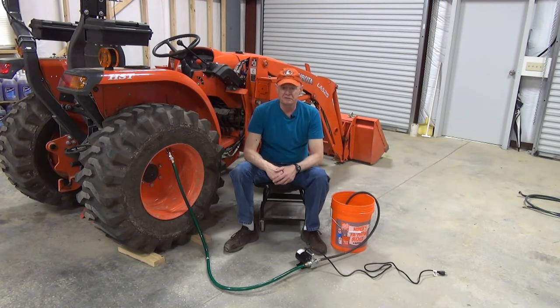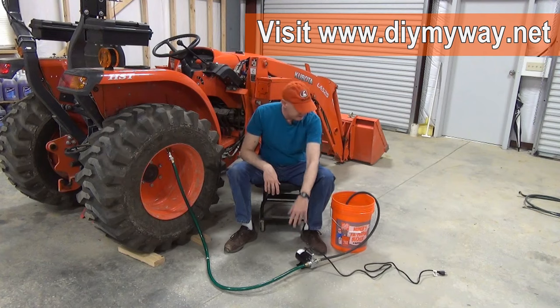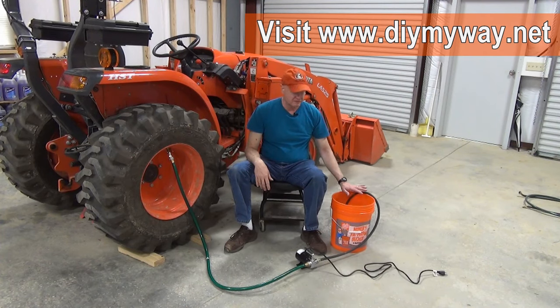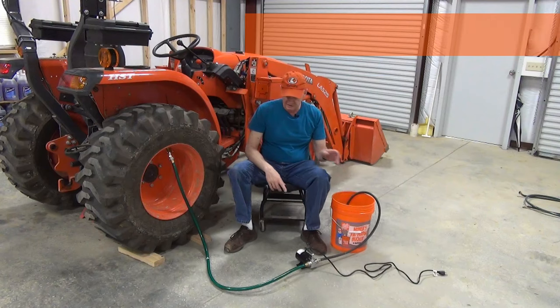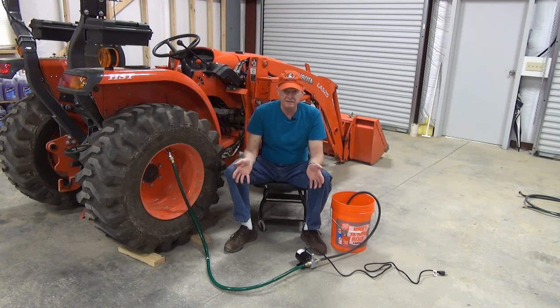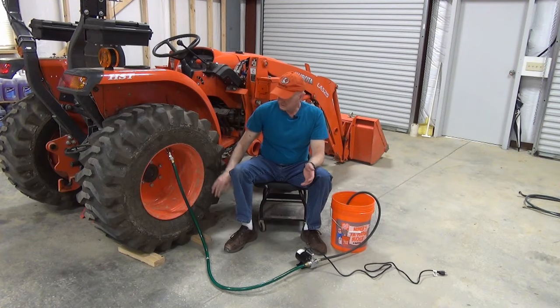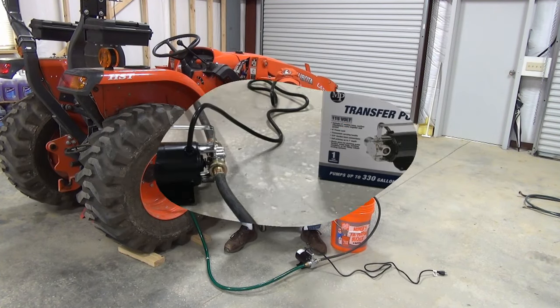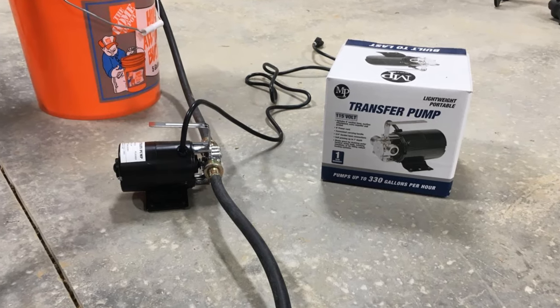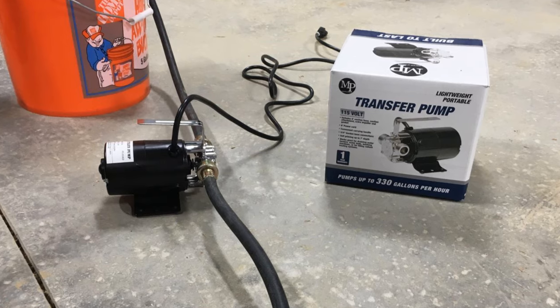Probably the most common approach to filling tires with fluid is to use a simple utility pump like this, a bucket or a 55-gallon drum, a couple sections of hose, and the same connector. The advantage of this setup is that the utility pump will fill the tire a lot faster, and it can help maintain some pressure in the tire to hopefully ensure it doesn't come off the rim while filling. Transfer pumps like this are available from many retailers such as Amazon, Harbor Freight, and Northern Tool — I got mine from Amazon for $66.